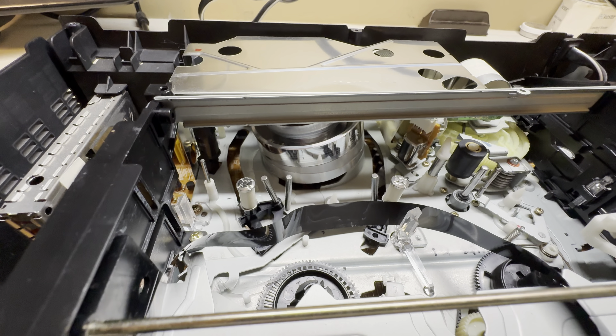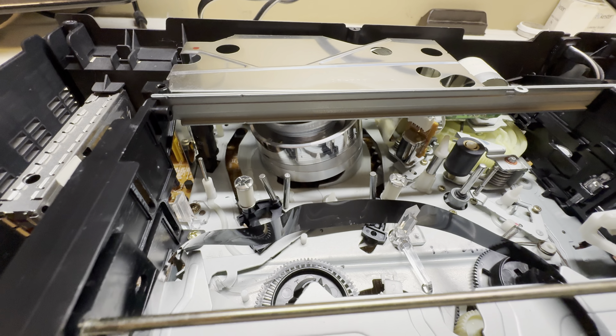This video is a repair of an SV2000 VCR. It uses the older Fu9 mechanism and I'm pretty sure it's going to eat the tape — but this tape's been eaten before so we'll sacrifice it. It does load it, and yep, that's what it does. To remove it, you want to get the tape over so it doesn't rip, hold the flap up and pull the tape out. So it has an issue of eating tape and we'll figure out what's going on.